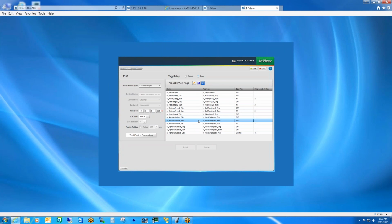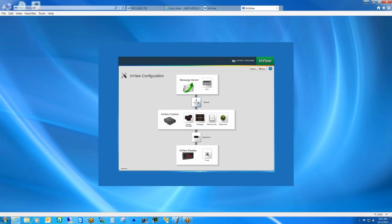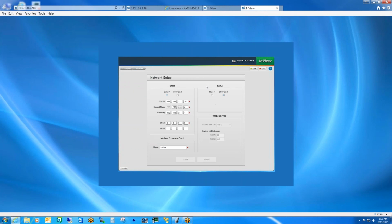Okay. I've got a couple other questions. Number one, whenever I get this thing out of the box, separate from DHCP, does it have a static IP that I need to set my PC to? How does that work? Yeah, it does. It has a static IP. When it comes out of the box, the Ethernet 1 port is set up by default for 192.168.1.100. Okay. So your PC would have to be in that network, and then you could go in and make a change.